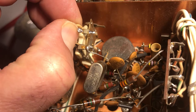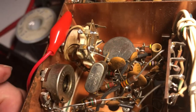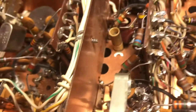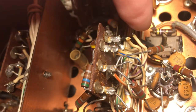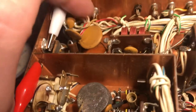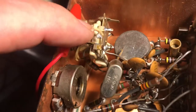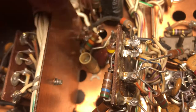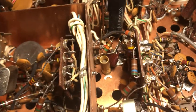This wire here is the sink or the ground, so the relay goes through this ground. But actually the relay is powering other circuits through its windings, which is kind of nefarious and sneaky. I traced this wire and it ends up over here — one goes down to the transmitter keying circuit, which ends up going into the finals. This other wire goes back to here, and then we're left with this board, which is an interesting little conundrum.